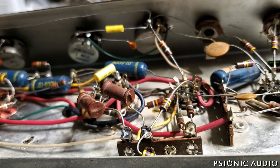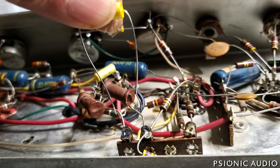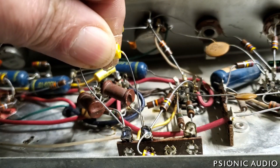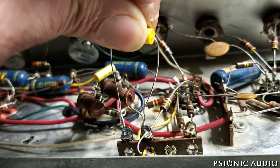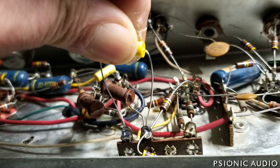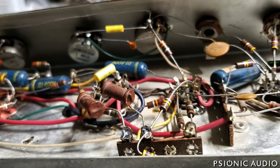This amp sounds good. For the purpose of this video, I'll very carefully put a 22nF cap across that junction shown in the schematic. You get that gain increase, but all the swirliness of the vibrato goes away. It's not just a gain increase though — because of the nature of it, it's a filter, so the gain goes up for the bass and mid-range but not so much on the treble. So I think this is the amp that will go out — without the cap.